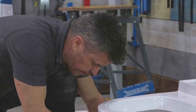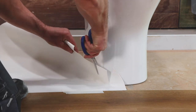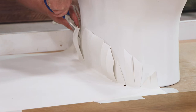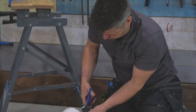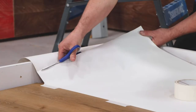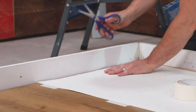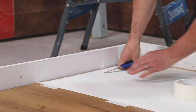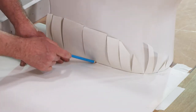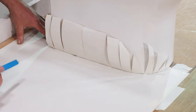As you can see, I'm cutting down the paper to meet the floor. This allows it to fit comfortably around the pan. I'm also going to cut down the opposite end of the plank where it meets the skirting board. This will be the equivalent of your expansion gap when you have your flooring plank in place. After this, I come back to the base of the toilet, using my pencil to scribe the curved shape that I require cutting.